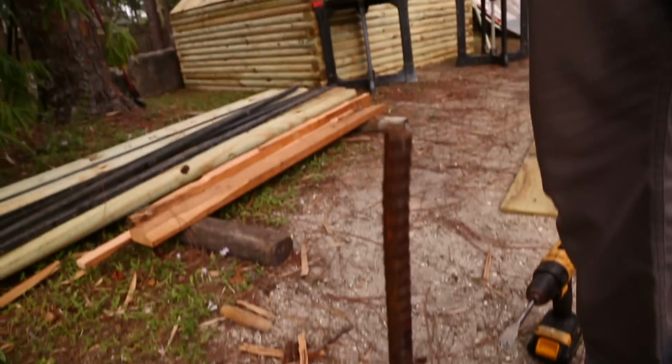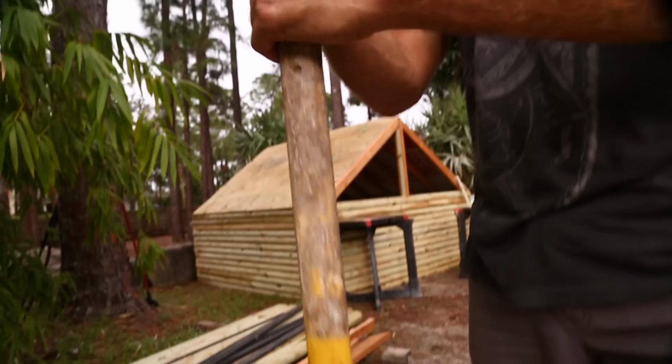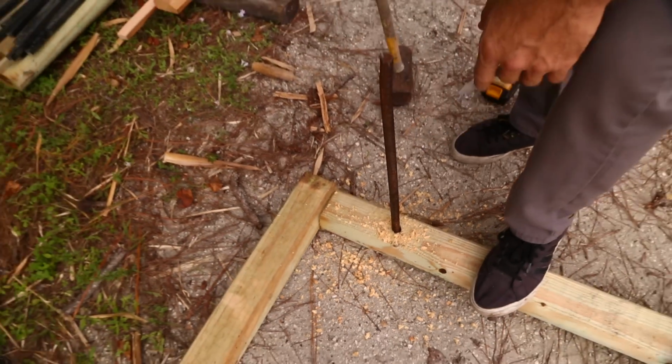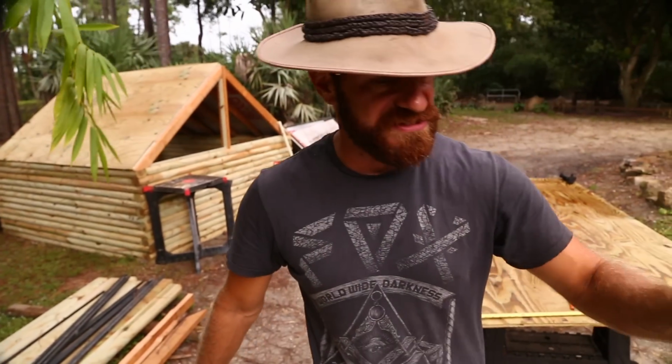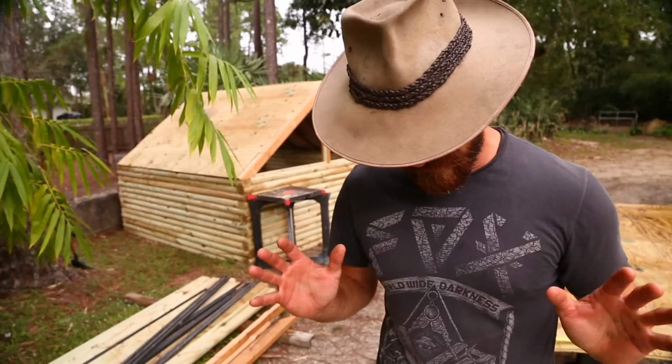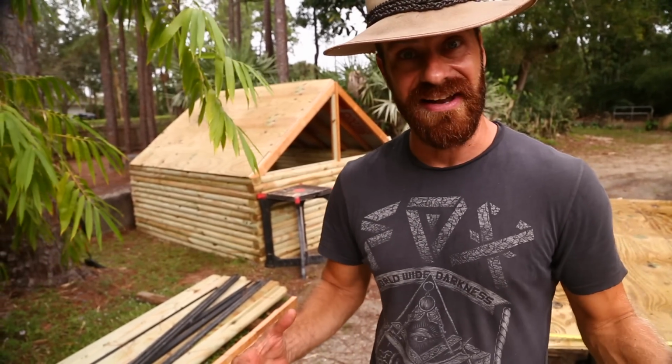And I like to just go pile driving it. So you'd bang this stuff down. I don't want to do it because it's in the middle of my driveway. But you would bang this down, and then you'd put about 2 pieces of rebar per board or per pole, and that firms it up. So it's been leveled, it's been attached to the ground, now it's not going anywhere.